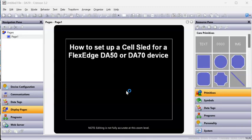First of all, you've got to get a SIM card from a provider, and it's got to be a SIM card that's a data plan, preferably one with a static IP address. If you go to your local Verizon or AT&T store and ask for such a thing, usually those stores won't have a clue what you're talking about, and they'll sell you a SIM card that goes into a cell phone, which is a different type of plan than what you need for one of these that is all data. Anyway, I've got a couple of custom companies that I'd recommend.